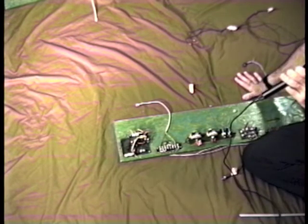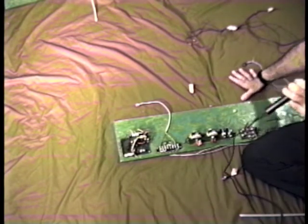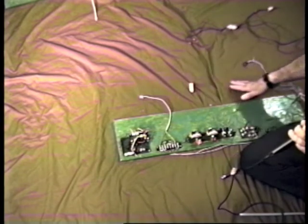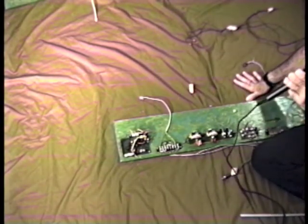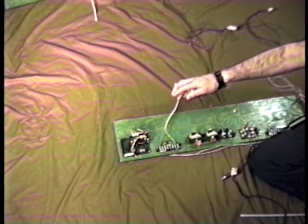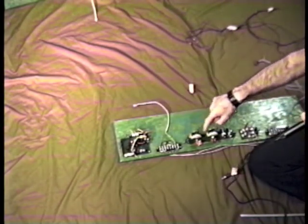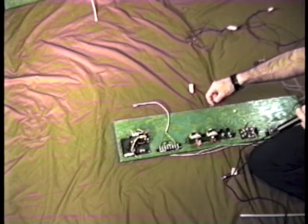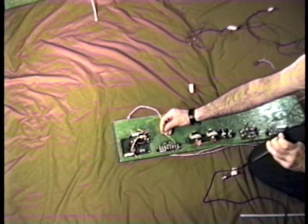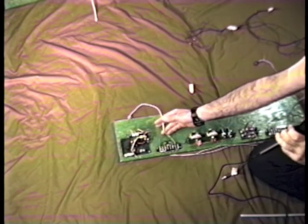You've got a standard telephone connector on one end and four spade wires on the other. Somebody might comment about using heavy wire for power on LGB — like 16 gauge or 14 gauge — but here I'm using very light wire. It seems to work fine. This wire is just used in this block section; it's not powering the whole layout, just the trains in this block. Plus I'm using resistors to drop the voltage anyway, so even if there's additional resistance from these small wires, it really wouldn't be a concern since we're using rheostats to drop the voltage in both parts of the block anyway.